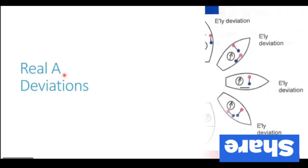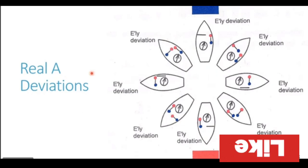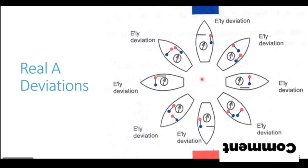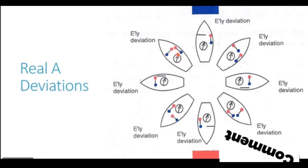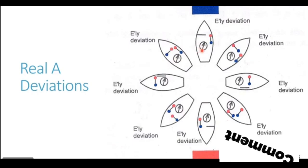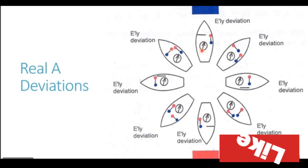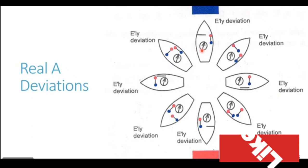Now this is understood by making a deviation diagram. For every coefficient, we will be making a deviation diagram like the one you see on the screen now. We have the ship on different headings: north, northeast, easterly, southeast, south, southwest, westerly, and northwesterly. So cardinal and intercardinal headings, the ship is shown on these eight headings. And in each of these headings, we are going to analyze how these horizontal soft iron structures, an unsymmetrical pair of horizontal soft iron structures, generate the deviation which does not change.